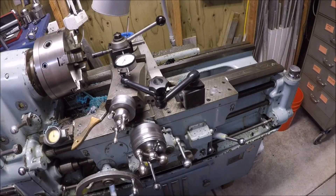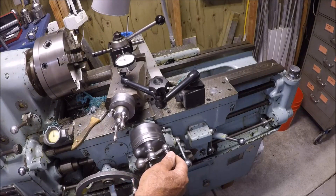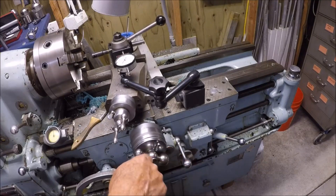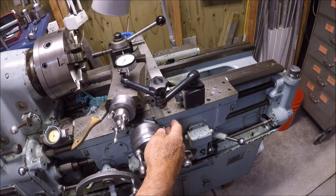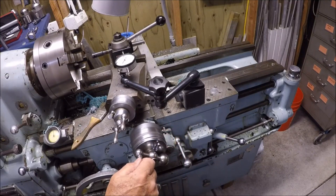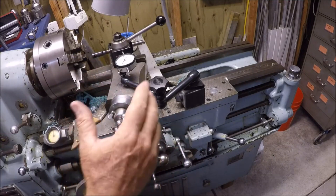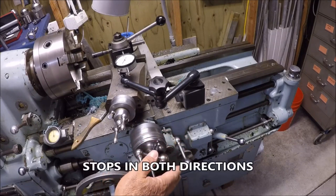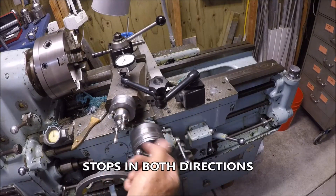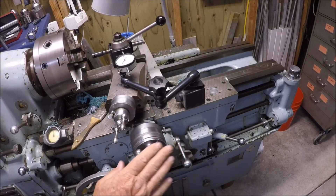The other nice thing the blade has is it has a stop. When you pull back out, it stops — set by this thumb screw here. So when you come back to your cutting position, either direction — in or out — you always go to the same place. It takes a lot of pressure off threading, because I used to always get confused about how much I backed out. It really makes it simple.